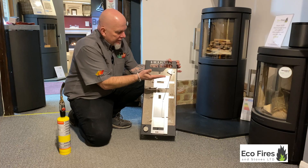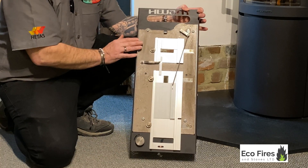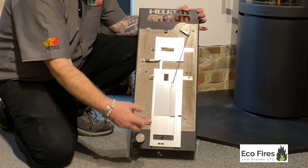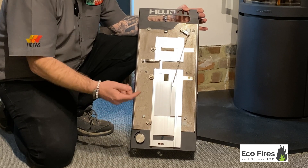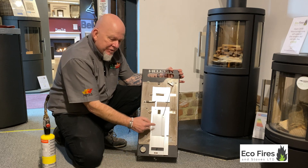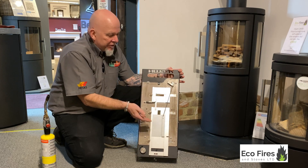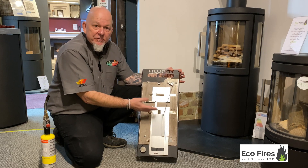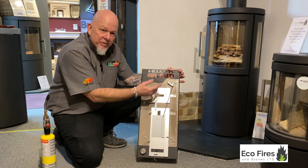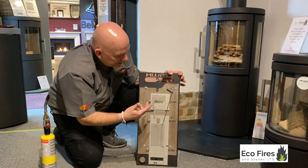It's quite simple when you see it working. You've got your three main air inlets that you get with any other stove — that's for lighting the stove, your primary air, which opens up and acts like bellows to get air into the fuel bed and get it up to temperature. Once that's up to temperature, you'll see this start to close off, then it opens up your tertiary air and your air wash. The tertiary air is basically like a turbocharger on a car — it re-burns the smoke at the back of the stove. The air wash is what you use for your main control once the stove's up to temperature.